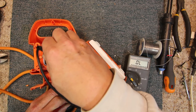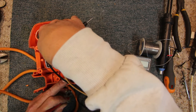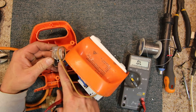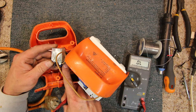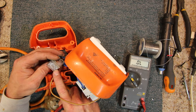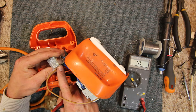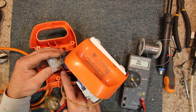The relay looks a bit cooked on the coil now that I see it. We've got relay active and neutral, and it looks like they're connected to the coil. The active and the neutral are soldered to the switch positions on each side. So whenever there's power on this unit we've got active and neutral going to the coil. This is obviously a 240 volt coil relay — it reads Cleon 10 amp, 240 volt AC / 28 volts DC, which might be the rating of the contacts.